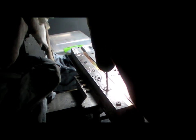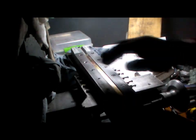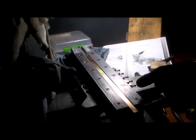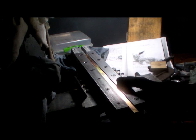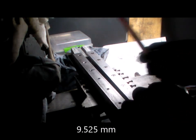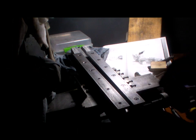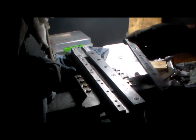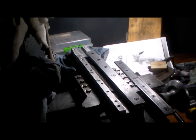This time I put these bits onto the head. Don't forget when you're in metric countries, 3/8 is a little bit under 10mm — 9.84 or something. So yeah, use a bit of 10mm keystock, not 3/8 keystock or 3/8 tool steel. I've done that mistake before. So there we have the positions marked out. Drilling and tapping — bring you back.